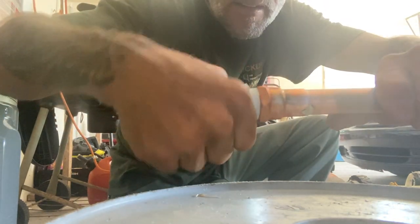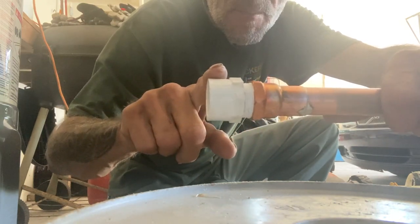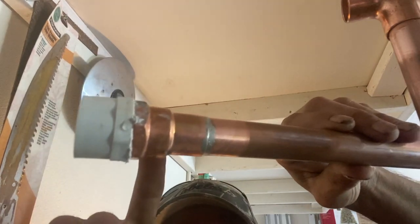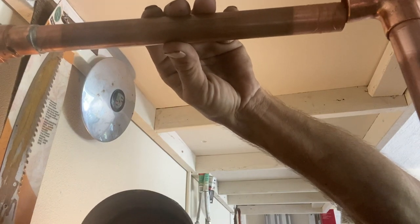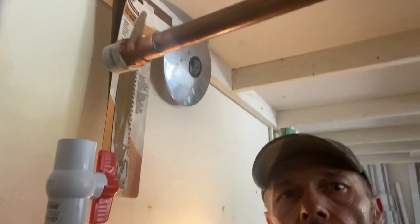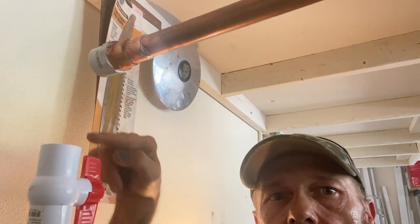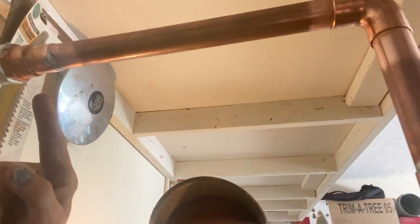There you go — they're getting married. Put a wrench on both of them and tighten them down. That's our product: PVC to copper. No heat. We preheated the copper and cooled it off. I'm going to set this up into a 90 that's going on our water heater. We'll get a measurement from here to here and put a 90 to 90 in there. Never put any heat anywhere near where the PVC is.